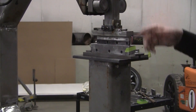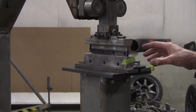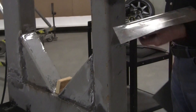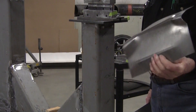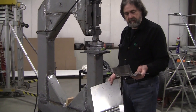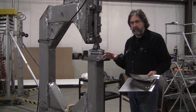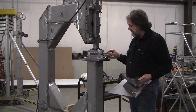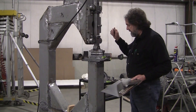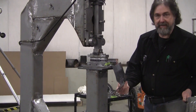Frank's been experimenting with the press. Aluminum went really well, but when he went to steel, he had results like these — obvious failures. What happened was the gap was adjusted properly, but the hold-downs weren't sufficient to handle the pressures created when doing steel. You set your clearance, tighten it down, actuate it, and it forces the die forward, which opens the clearance up — causing disaster like this.